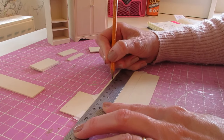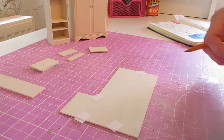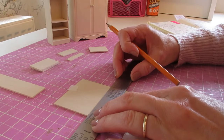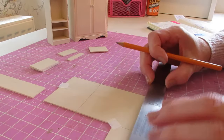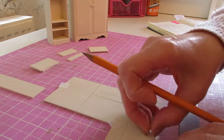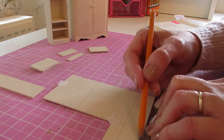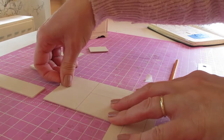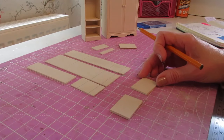98 millimeters — 3 and 7/8 of an inch. Turn that piece, join those marks up, placing the rule just below to allow for the thickness of your pencil nib. Remove the tape at the bottom so you can get your lower pencil mark all the way across, then remove the other pieces of tape. Push those pieces to one side and bring in the two thick shelves.